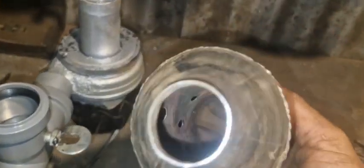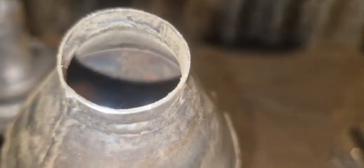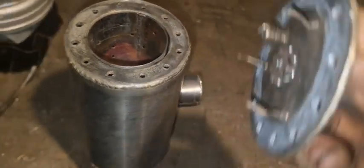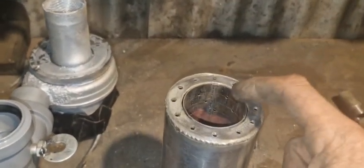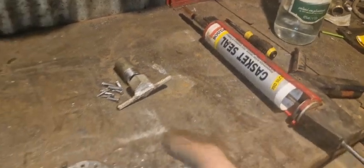This slides in here — you can see it's more or less sealing off. It sticks a little bit outside, and that's good because then we can squeeze it in and that will decrease this gap. Some place you have a little gap between the converging part. And then you have this little thing to hold it in the middle. Because this is not getting as hot, I'm going to use high-heat silicone and not refractory cement, because that messed up the screws.